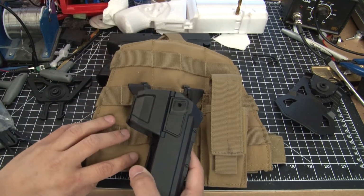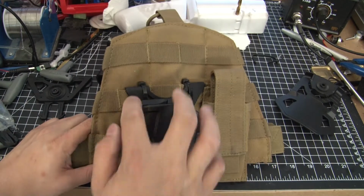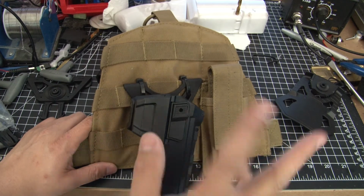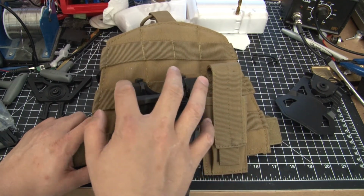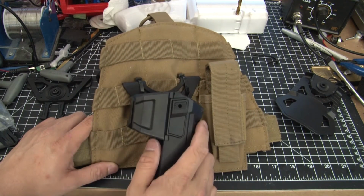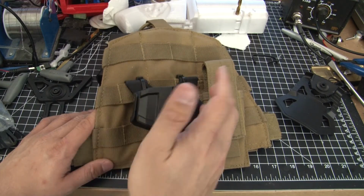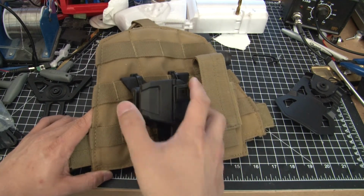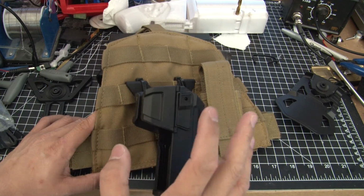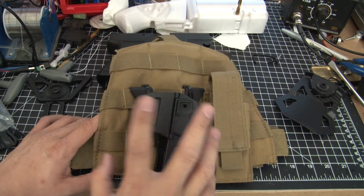You know what, in 3 or 4 years when HP comes out with more materials, they may be able to color this a tan color, because they're working on adding different ink jettable materials as modifiers. They already do this with a detailing agent and a fusing agent jetted onto the nylon powder to get it to fuse with great surface finish. However, if they can add color, it may actually be worth redesigning the entire system so I can make this, with some modifications, in whatever color I want to fit the holster pattern for the Glock perfectly.